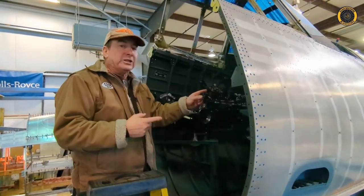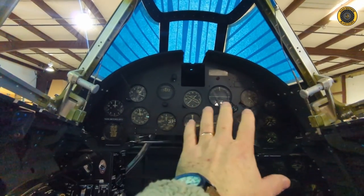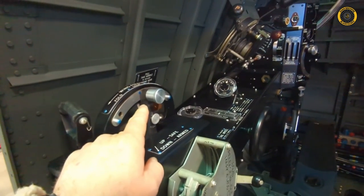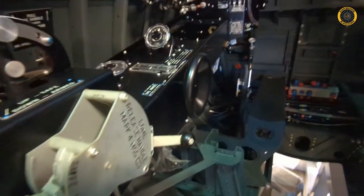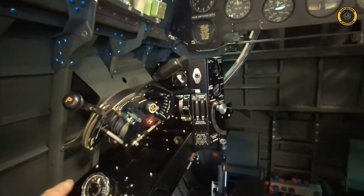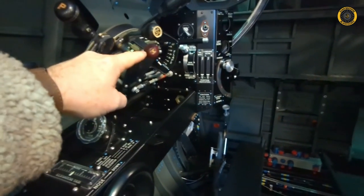Let's go inside the cockpit of this birdcage Corsair. There's the birdcage canopy which gives it its name. Pretty standard set of instruments on the instrument panel. First off, we've got the lock for the wing folding mechanism, the wing fold mechanism, and a bomb rack location. We've got aileron and rudder trim, elevator trim, and a tail wheel lock and unlock. On the throttle quadrant you've got your propeller control, your throttle, your supercharger — remember those three stages of blower — and then a mixture control.